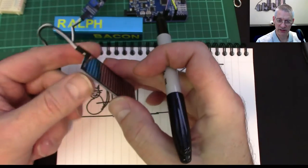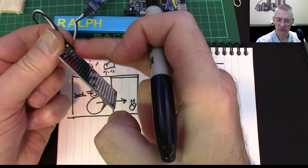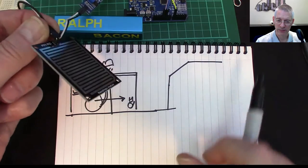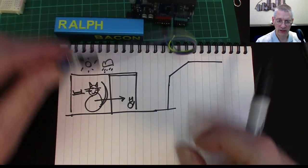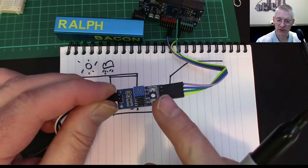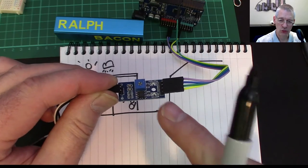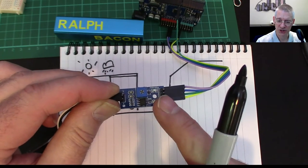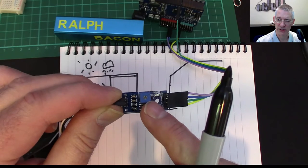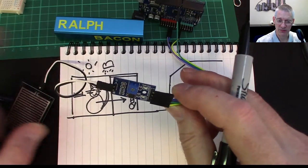We've been caught out a couple of times with the UK climate, so I thought let's have a rain sensor out here. This can be mounted at 45 degrees on the roof so that the rain drips down it and doesn't pool on top - at 45 degrees it'll make contact and let us know. This little module that comes with it has two outputs: an analog output of 0 to 5 volts and a digital output that gets switched on at a threshold set by this pot, so you can adjust it.